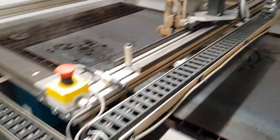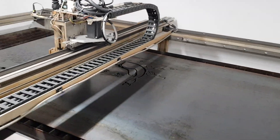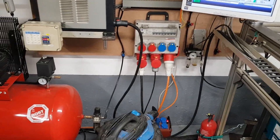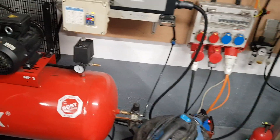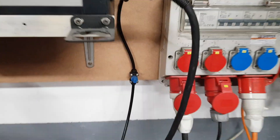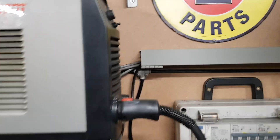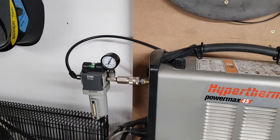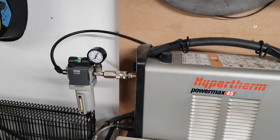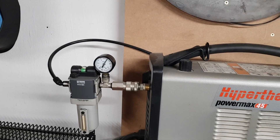I tried to clean up some of the wiring as best I could. As far as the air goes, I put a lot more shut-off valves on the air system. Everything runs from this compressor here to the air dryer, then up to a main shut-off valve to a T. That T runs into the plasma cutting machine, which also goes through a water filter with a gauge so I can see that it's hitting 6 bar.